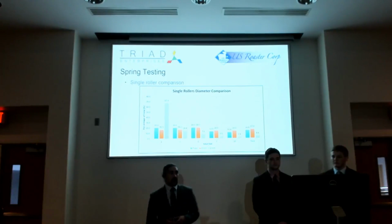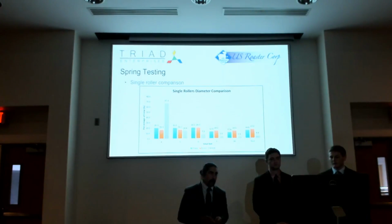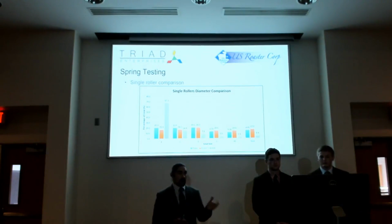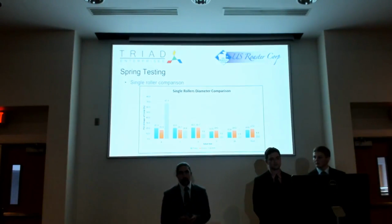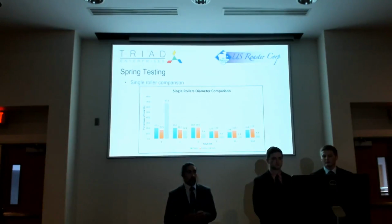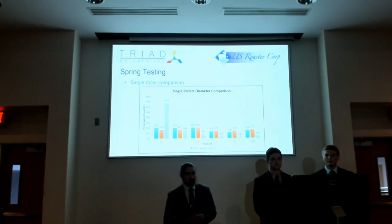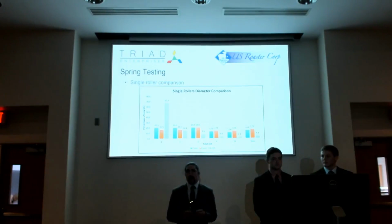This graph shows various roller gaps at a single speed. So here we have a 7mm, an 8mm, and a 9mm roller gap. Again, we can see that the 9mm roller gap had very little dust waste, but again we have a large amount of large particles at the very first sieve, which was due to beans not being cracked. You can see that 8mm was our threshold that we found for getting all the beans to be fully cracked and to start seeing a more uniform spread across all of our sieve sizes. And then 7mm also helped mitigate some of the dust and waste production.